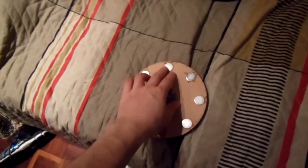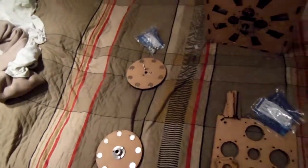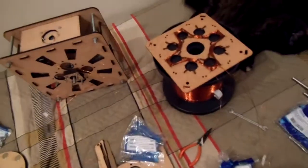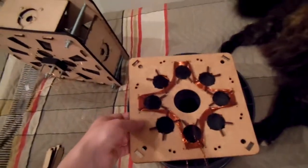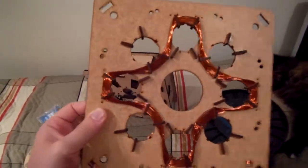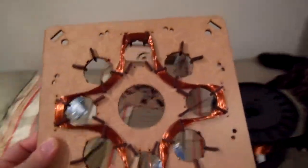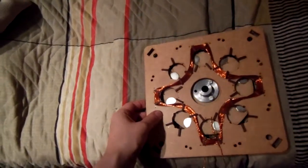I'm going to have a strong magnetic field between those rotors, and between them I'm going to put this coil. I have two coils here — one on each side — and they are 90 degrees to each other. The idea is that the strong magnetic field will cause induction in this coil.